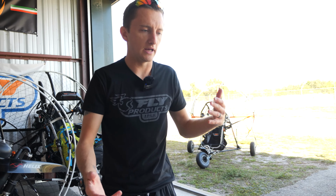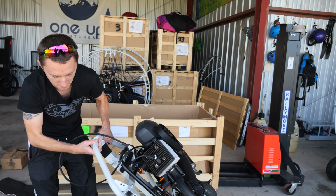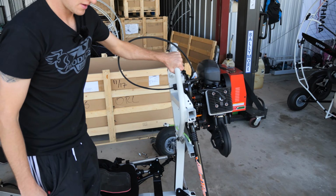Now once that's in, all we have to do is lift up the center mainframe. Now once we get to here, you just pull out this pin and this can fall. So do not let go of the center frame. We are going to, oh, I see, okay. So you might have to tip it just a little bit one way to get this to line up properly. Once it's lined up, straighten out this pole and put the pin in. Then we go to the other side.